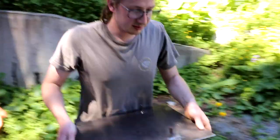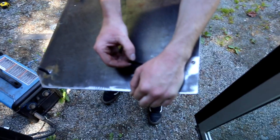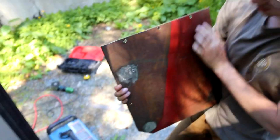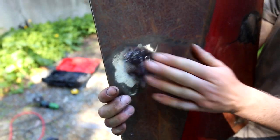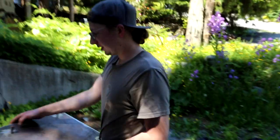What we do with these studs, so they're pretty solid. We throw them in the air like that and make sure they're really hard. Now, we drill a hole and dip it in. You put some four little tacks around here, get it in the right place, and flip her over, which I need to polish this up yet, and then you weld round the stud. That's why you stripped it back. It's solid. It is part of the steel once it's in.